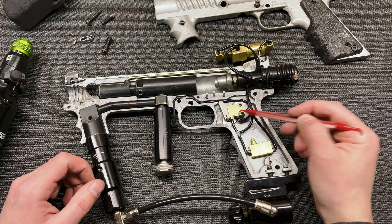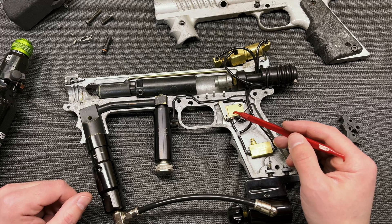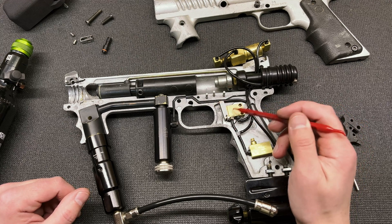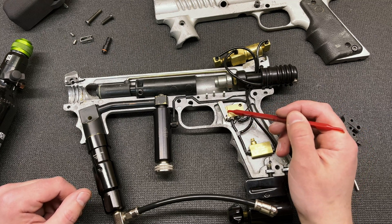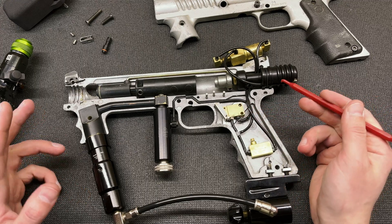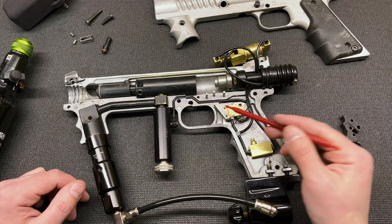The line goes to our main switch here — this is the Fabco MSV2, a very common switch for paintball mods, typically used in new cocker and new mag builds. It's essentially a three-way on/off switch that vents, and it has a very light and rapid actuation. The one downside, which I've decided to accept, is that when held open it will actually leak a bit of air around the stem — the stem is not sealed, which is a design choice. So this valve is very smooth operating, but you have a slight leak when held open. Not a big deal, but if you were trying to build the most efficient setup possible this probably wouldn't be the switch you'd go with.